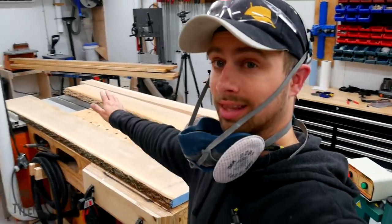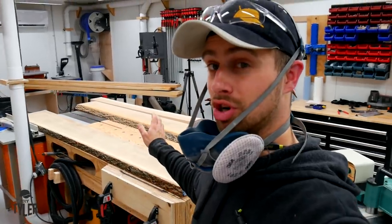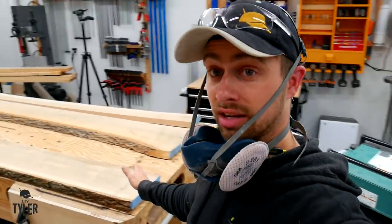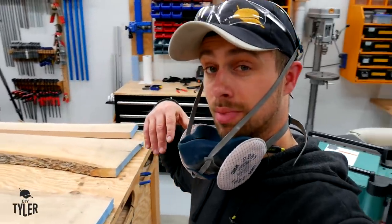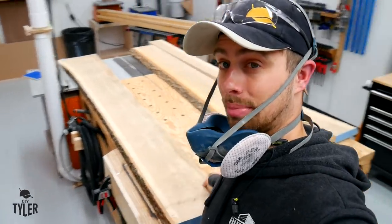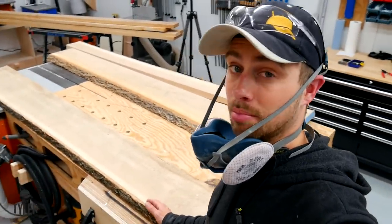To get started, I'm going to use the track saw and lop off the end so that these boards are 94 inches long, which is all I can get across the shop here on the milling machines and I even have to move them a little bit kitty corner to make even that happen. So we'll do that on the track saw and then we will move over to the milling machines and get everything flat before going back to the table saw and lopping off the unstraight barked sides.